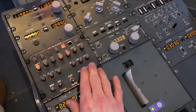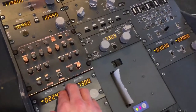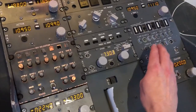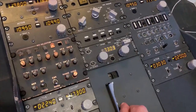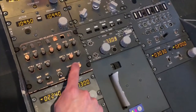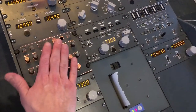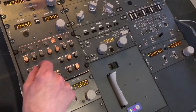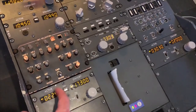I also managed to install this OEM panel — a panel from a real aircraft. I reckon this is from a Boeing 727, so it's been flying around the world for about 40 to 50 years. It's tricky to interface though, because the audio logic in this box is different from normal simulator logic. Here you have potentiometers and switches sending signals into a computer where all the audio processing happens, whereas on this box the audio signal goes directly into the box, is amplified, and then goes out to the speakers. That's a totally different logic, and that's why I haven't interfaced it yet.